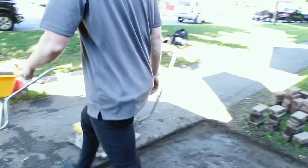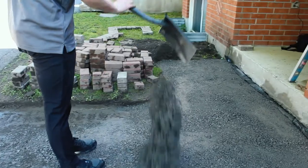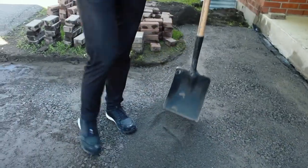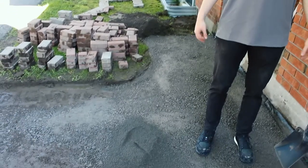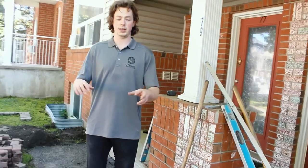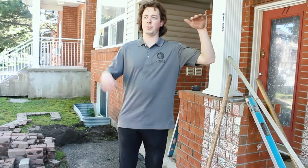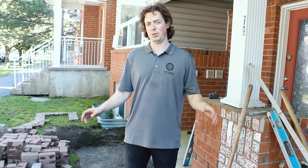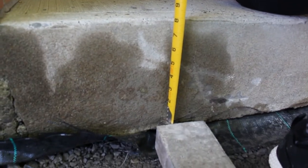You're supposed to use bedding sand, but most places in Ottawa don't even carry it, so we use stone dust. It looks like this. It's very nice to grade with. You should be using bedding sand if you can — if you can't, this stuff's fine. It's not great, but it's what we use because everything around us is built like this. With all our repairs, we basically use stone dust because that's what everyone is using. It keeps it uniform.